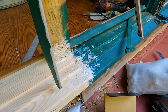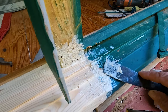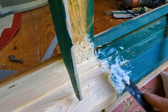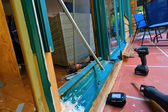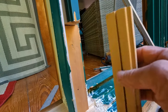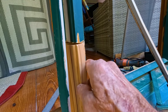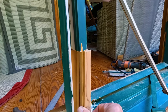We've got putty covering these, and there's a little bit of rot right there that I don't want to cut out. So we've got the putty in here - hopefully this will all dry hard. Then we'll come back here with a sander, sand all this, prime it and paint it. The next is this piece - I've got that piece in now. The sill is in. And we're going to put this - it's called a mullion. We're going to put that mullion in right there. It may not be exactly right, but I think with paint you won't know the difference. Kind of look like that, huh - hey, it's not bad for a hack.